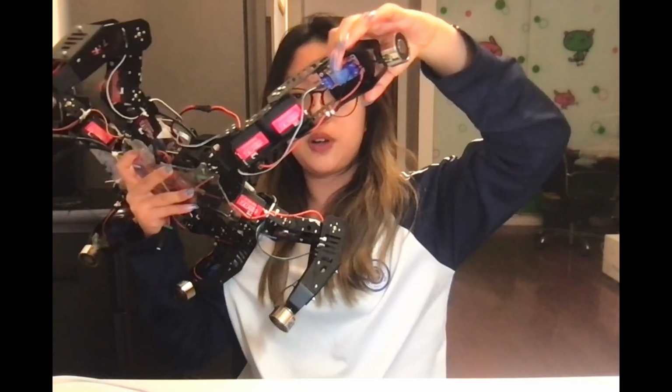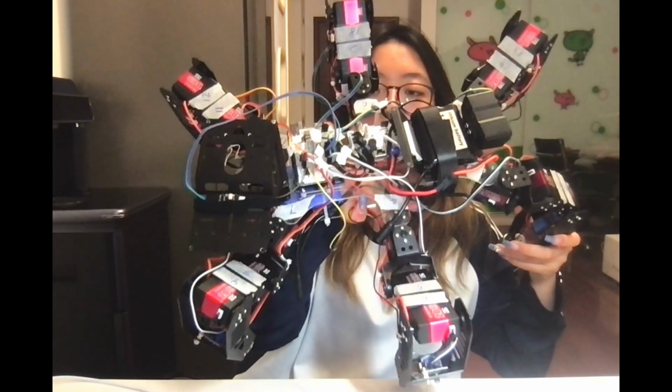So I can measure the robot's tripod gait by hand by dividing each movement into 6 or 7 small parts, and record the distance and angle of each main line servo and combine them all together. And then I wrote the servo control and relay program in Arduino code. So here is where the relays are, and here are the 2 main boards. The code includes the movement data of the bus servo control and also the electromagnetic attraction switch control.